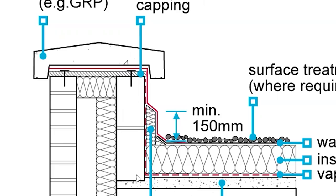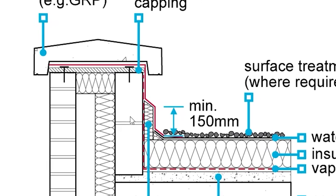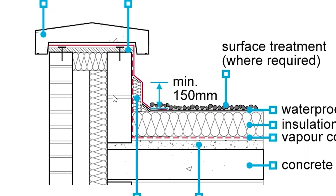But this bit about cold bridging — if you just ran that insulation through there, you could run a course of blocks on top of it, or just put down a wall plate and run a course of blocks on top of that. My idea was you just make up a little bit of stud work, face that off with a bit of cement board or even OSB, and then run your membrane up the top of it. Because that stud work — you've got insulation in it — doesn't transfer the cold, or rather doesn't transfer the heat in quite the same way as masonry does.